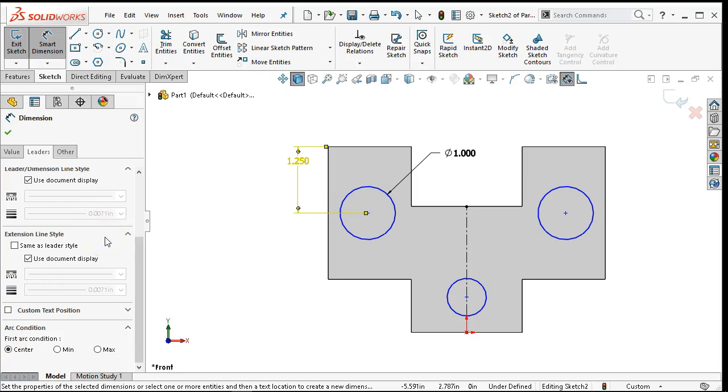All right, so if I was reverse engineering, you brought me a broken part and said, I can't find this anywhere. I need you to reverse engineer this and make me one. Rather than calculating the center, chances are if it's broke, it's deformed, it's out of round, something happened. So I'm going to assume the original design had basic fractional or basic metric dimensions and tolerances in it. So if I can get those values, then I can take direct measurements from the edge to the edge of a hole and put that value in as a dimension number without having to calculate the center.